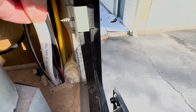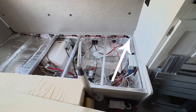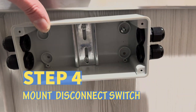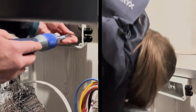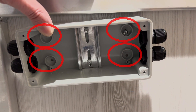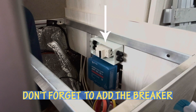I had to open up the storage area under the refrigerator to pull the wire through because it bunched up. While you're in the area of the wire bundles, you can also run the Victron VE Connect wire down the wire bundle if you're going to be using the Victron screen. Step four: install the solar disconnect switch box to the area under the driver side twin bed. I kept the cover off so I can get all the wires in first. For this particular disconnect switch box, I needed to drill holes for the mounting. Don't forget to clip in the circuit breaker into the solar disconnect circuit breaker box.